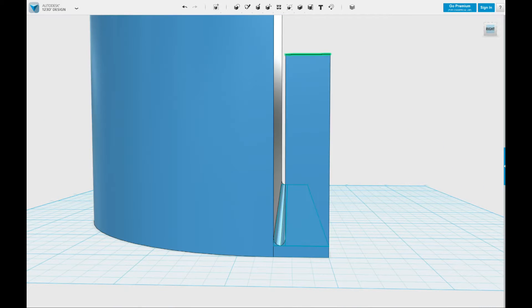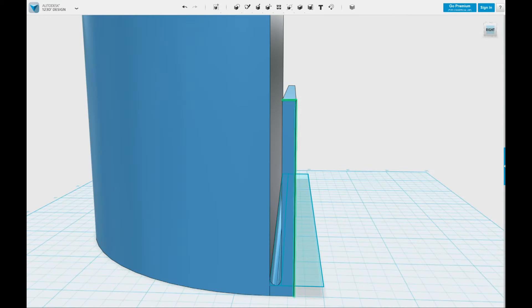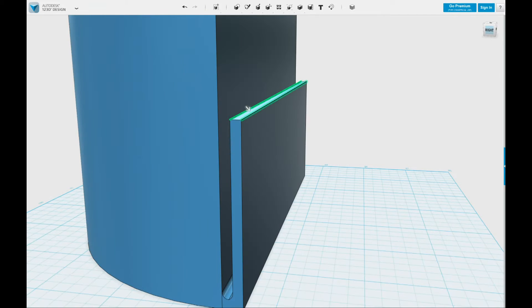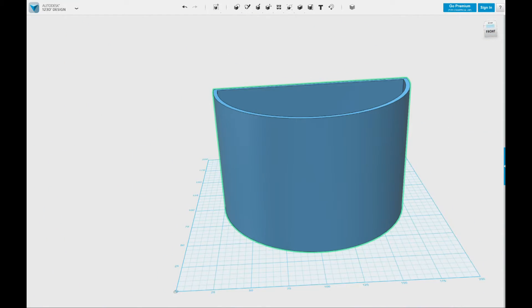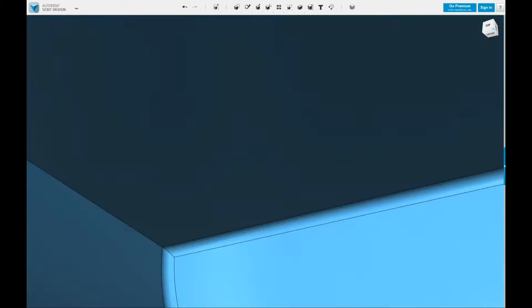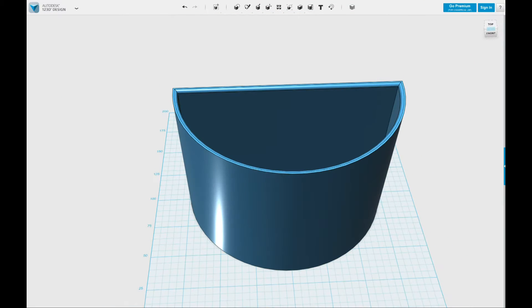I have to make it a little smaller. I made a slight miscalculation — it has to be a bit more reduced, so now it's also three millimeters thick. I give it round edges because round edges make it way stronger, and also on the inside I'm giving it round edges. I check all the sides to see if everything is correct, and now the top layer will also be chamfered to make it stronger. The wall thickness is three millimeters thick.